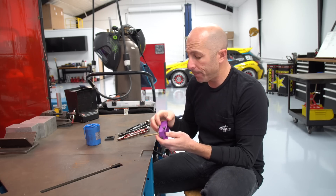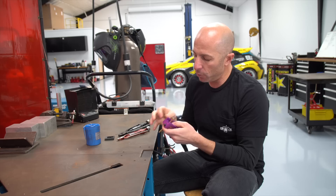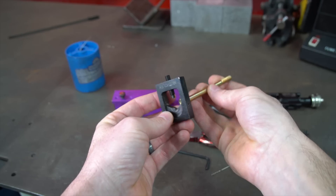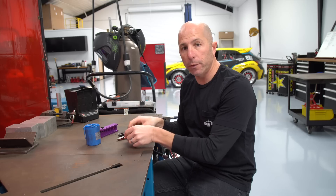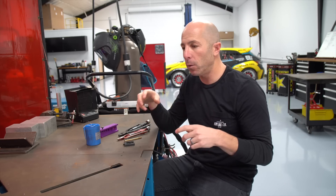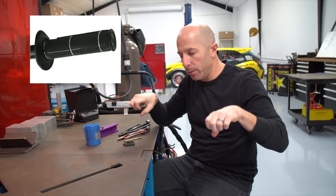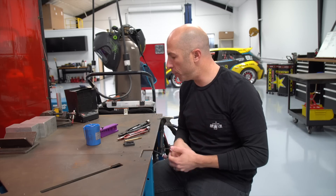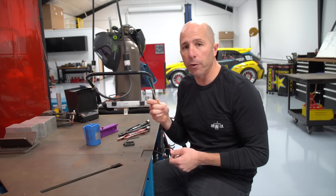We'll go do that in a little bit. This fixture drills straight through the center of the bolt, but you don't always want that — you may want to drill the corner of the bolt. So this is a different safety wiring fixture; this one is pretty universal and lets you drill through the corner. In addition to bolts, safety wire is really good for hand grips on a motorcycle, dirt bike, or even a BMX — sometimes they'll want to slip, so you safety wire the grip to compress those areas and they don't slip. Let's go over to the mill — you can use a drill press as well — and drill this bolt right now.